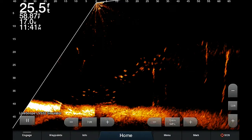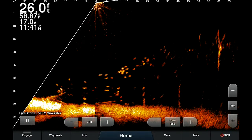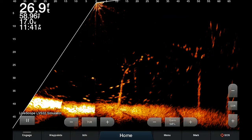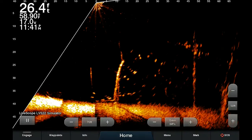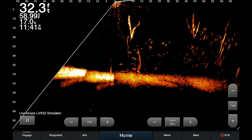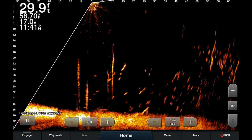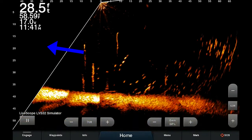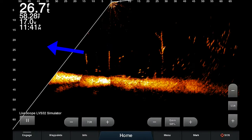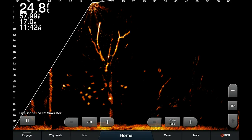Personally, where I think I'll use this most is when I'm fishing with the transducer in forward view but fishing close to the transducer — vertical jigging or fishing in a nice hole. I actually like the Full reverse range because I can see as much directly below me and a little behind me as possible. The trick I've found is to move the bottom of the lake as close to the bottom of the screen as you can, so you're using as much screen real estate as possible. Otherwise you end up with a ton of blank space on the left-hand side, which isn't ideal.